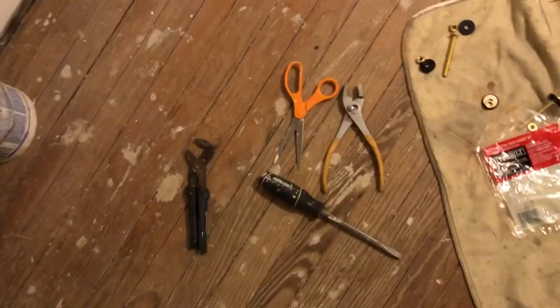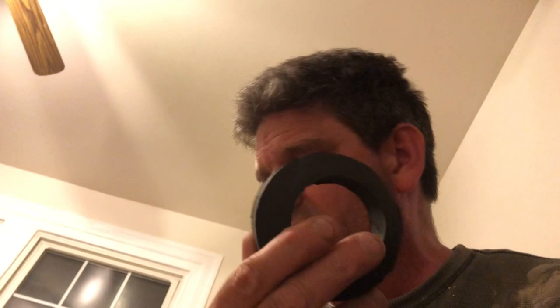I did forget to mention that the size of the gasket is critical. This is a two-inch — or according to the packaging a two and one-eighth inch — inner diameter. I think the outer diameter is three and a half inches, but that's going to be critical for your toilet. Some are bigger. The one I also bought measures about two and three-eighths inch — I assume it fits over a two-and-a-half-inch opening. I'm not taking that out of the packaging because I'm returning it. It's not right for my toilet, but this is critical.